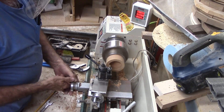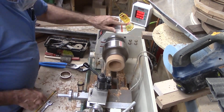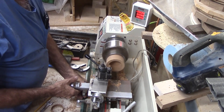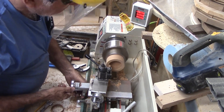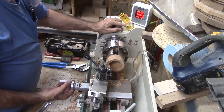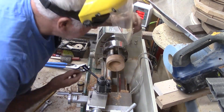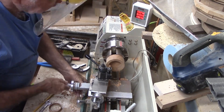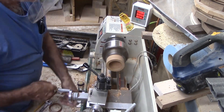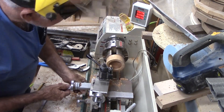Now let me introduce a new tool. This is a small metal lathe, Grizzly G0768, with a digital readout — a DRO. With a special spindle adapter, I can mount my wood chucks to this lathe. Wood tolerances are not nearly like those from metalworking, but this lathe excels at straight cuts. It is much slower than on a wood lathe, and I would not like to cut a smooth curve on a metal lathe — this is where my wood lathe excels. With the DRO, I can dial in to close tolerances for the insert. All this is possible on my wood lathe, but it is still a cut, try, cut, try process.